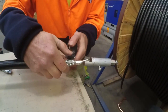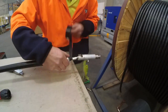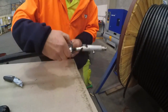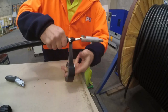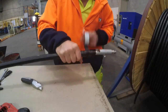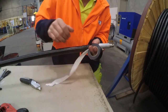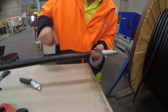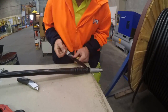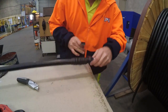Again, using the semiconductive tape, start stretching and wrapping over the aluminium conductor strands at the connection to the lower finial connector to start building up in multiple layers. Continue wrapping the tape over the area shown to cover the last 3 cm of the black insulation, over the lower finial connector, and up to the black plastic section of the mast butt assembly in multiple layers, completely covering the crimp and achieving as smooth and level a surface as possible, removing all sharp edges.